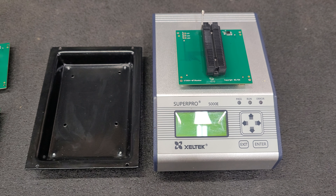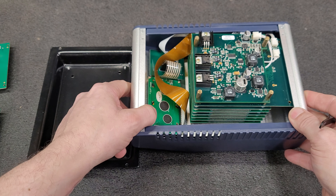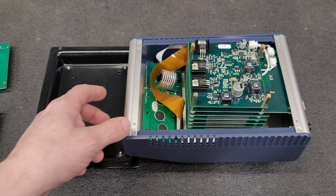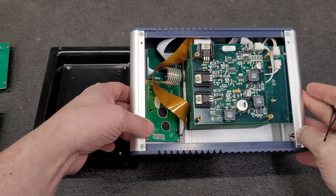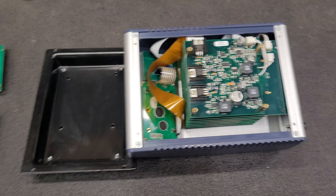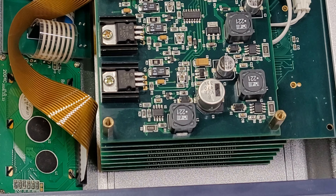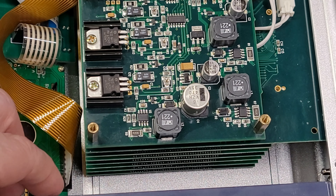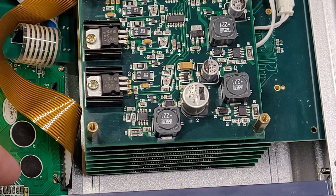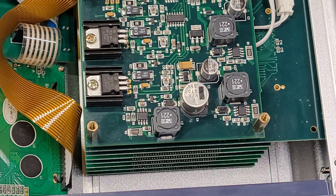What you'll want to do is replace Resistor R6. On the older programmers, it's right there — that is a 3.6K. You will need to change that to a 3.4K. It's an 0805, and you want 0.1% tolerance. You want that as accurate as possible.